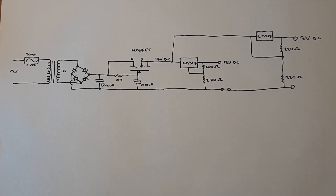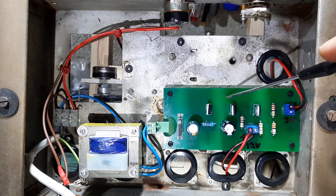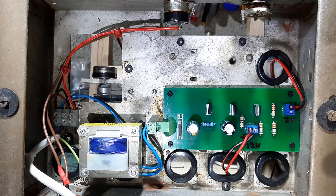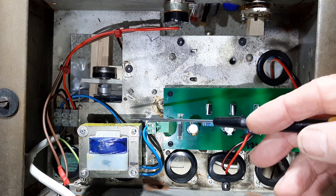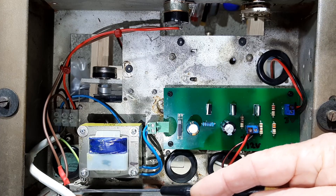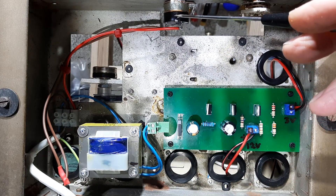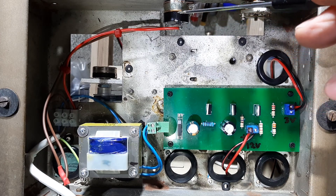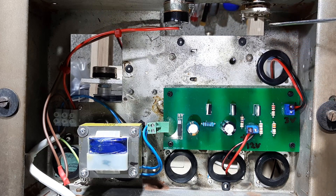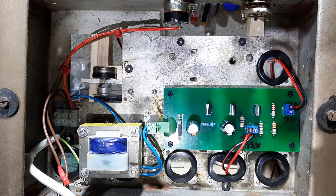The next phase of the project is to fit all this gear into the chassis. I have to strip it down first and figure out how I'm going to mount these modules and the various controls. I've stripped all the old components out of the underside of the chassis and fitted my little power supply board that's going to feed the 12 volt line and the 3 volt line up to the top side. Here's the mains power supply feeding that board itself at around 15-16 volts AC. I've fitted a fuse holder for safety reasons and a new mains lead, and up near the top you can see what will be the on/off switch - I've incorporated an unused volume control and just used the switch portion on it. Over here you can see what will be the band switch for switching between AM and FM.